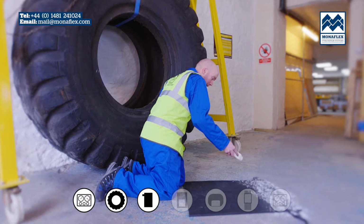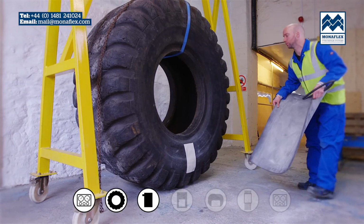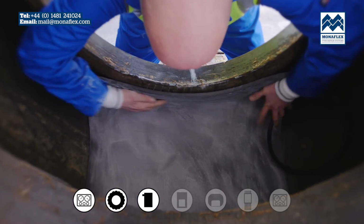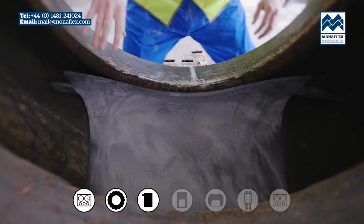Take the preheated inside heat pad and thoroughly dust both sides with tyre talc to reduce friction when using, and place centrally over the patched area inside the tyre. The heat pad should be orientated with the finger holes along the top edge, lining up with the bead and the labels facing towards the injury.